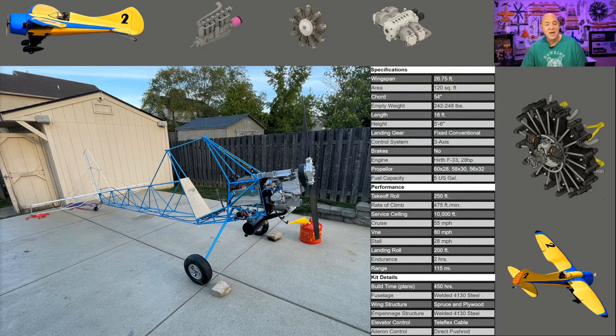I've had a couple of people reach out saying, how dare you show the drawings that you paid money for? I've emailed them and had conversations, and they hope that I encourage other people to build an Air Bike from watching. It's a single seat ultralight — all ultralights, if they're going to be Part 103, have to be single seat. The moment you make it two seats, you have to have your pilot license to fly another person. Even if it's 254 pounds or less, a two-seat plane can't be flown as an ultralight.